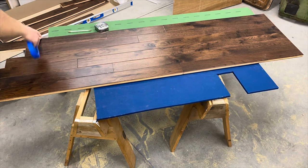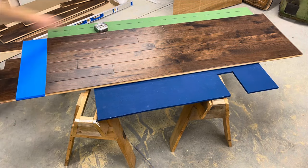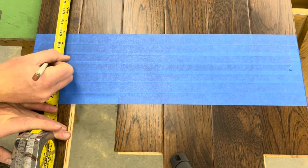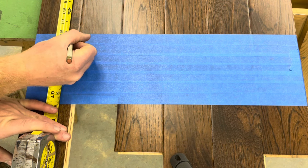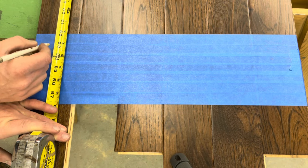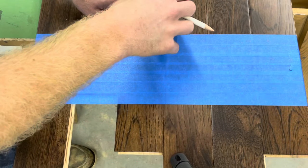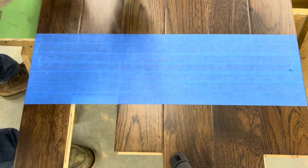Now you see me measuring out the final dimensions of 64 inches. I'm putting down blue tape to mark my cut line and help protect the flooring when I drag my circular saw across it. I should have cut from the back side of the flooring to prevent the chip-out you'll see — I always forget that the circular saw cuts up through the wood so the top side has potential to chip out. So when cutting with a circular saw, if you want to prevent chip-out, make sure the good side is down, cut from the back side, and use tape. I just used my level as a straight edge with clamps to hold it in place and then made my cut.